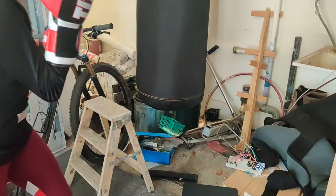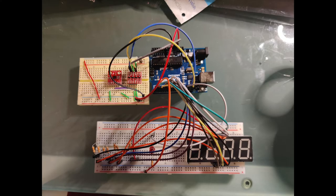My second approach, pictured here, was to use an accelerometer hanging from the bottom of the bag to detect punches and the force of punches. I chose to hang it from the bottom of the bag because the bag is anchored at the top, so the bag swings the most at the bottom, and it would be easiest to detect changes in acceleration with the device at the bottom of the bag. Unlike the force sensor, this is out of the way so the user isn't directly punching the sensor. It's a more involved detection of punches and force — here I'm detecting changes in acceleration, specifically large jumps that essentially come from changing direction, which signal that the bag has been hit.